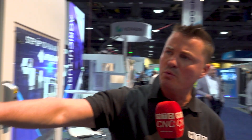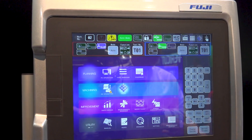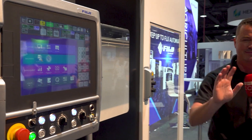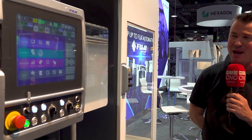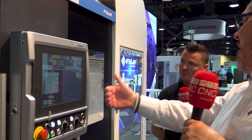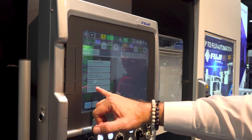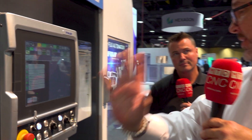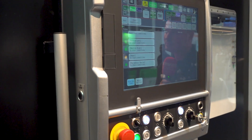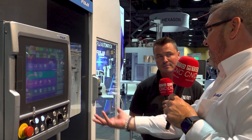I want to take a quick glance at this software. It seems so user-friendly. When I look at my iPhone or a smartphone in general, this seems very colorful and the screen seems friendly — a user would want to be a part of it instead of going, that looks like a whole bunch of numbers. On this system, we have two interfaces. One is the Fuji interface, which helps you set up the left and right spindle — what program it's going to run, speeds and feeds, different live tools. Over here, you go to the robot, and that gives you your start point, your teach points, and where the robot is going to move and change parts. On peripheral devices, if you're going to add inspection or pre-inspection, that would be done there. And then here is what most operators are used to seeing — it's a FANUC interface on the front end of the controller.